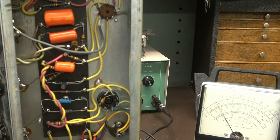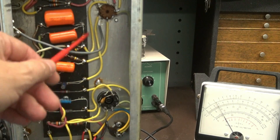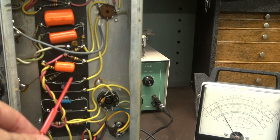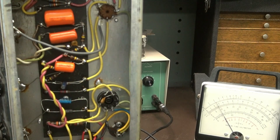Three new Spragues installed. Got the meter hooked up, doing the same test — audio generator input, tap on the caps, give the board a little workout. You can see: stable as can be. So that solves the intermittent volume problem. I'm going to go through and check the tubes, clean the controls, etc. But this is a good way to determine if you have intermittents on your eyelet board.